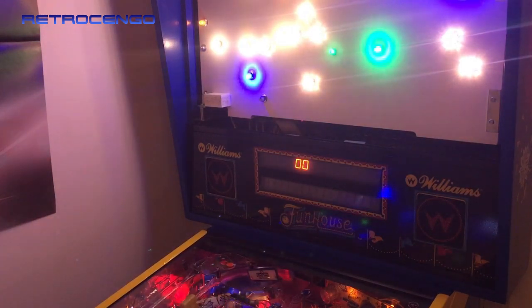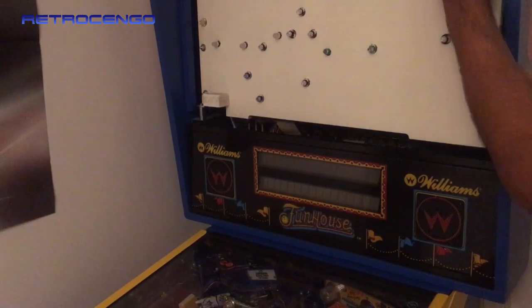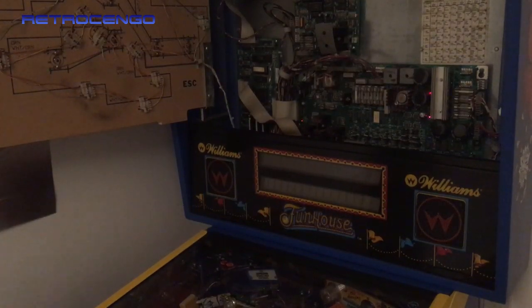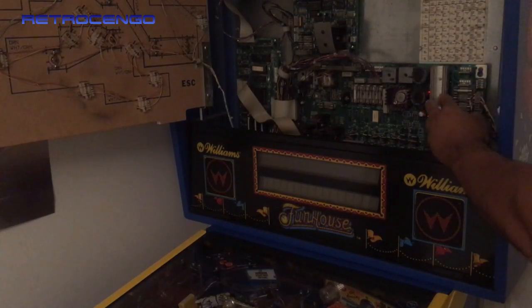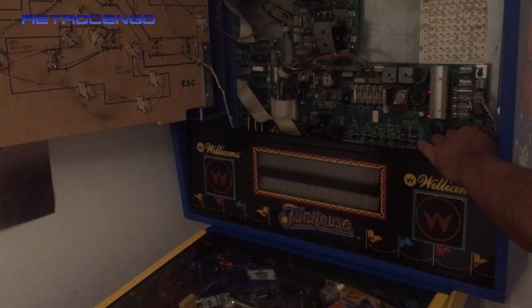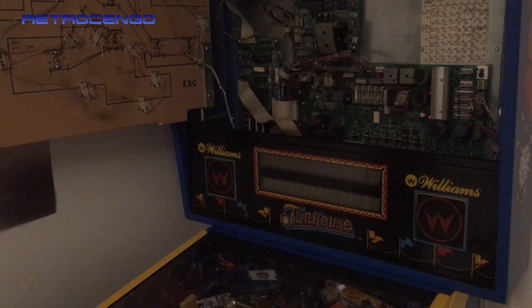All right, I'm just gonna go ahead and turn off the pinball machine. There we go. We're going to wait. All the lights have to go off, all the power in the caps and everything should just disappear. It's probably gone by now, I think. Oh, it has got new bridges. Yes, they're new. Oh, they're so far away from the board, man. That's nice. Great. But when you replace these, replace also the caps, man. That's just a must. Also, the little cap in there. Yeah, but that's another video. If you're interested, just write and I will explain everything.